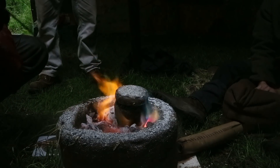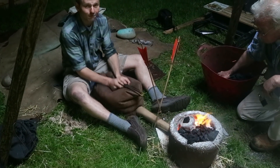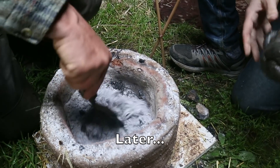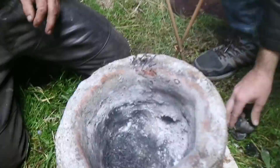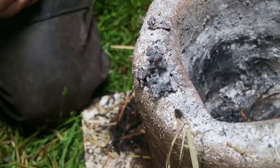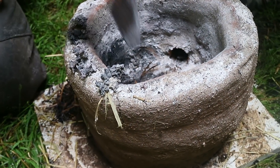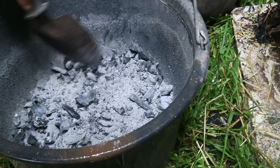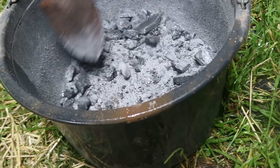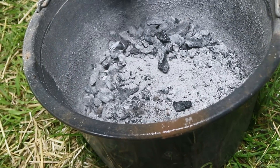There'll be an amalgamation of things — the whip of the slag. It was rubbish charcoal, right? But if that charcoal had been hot enough, all of this would have melted and pooled at the bottom with slag sitting on top, and we'd have just hammered the slag away. I'm actually grateful it didn't work so we could see the difference in charcoal quality — that's not something I would have been aware of before.